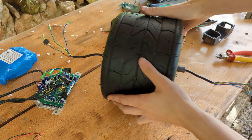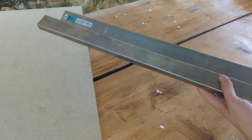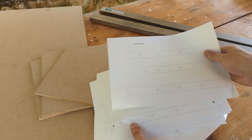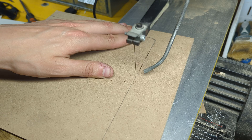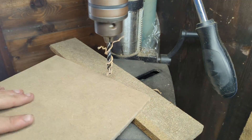We can now move on to fabricating the frame. The frame is constructed of 8 and 10 millimeter MDF sheets with the rails made out of 20 by 40 millimeter rectangular steel tubes. The MDF sheets can be cut according to templates — the link is below — making the two footpads out of 8 millimeter MDF and the bottom plates out of 10 millimeter MDF.